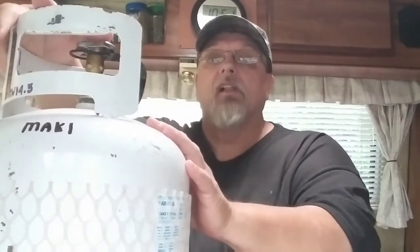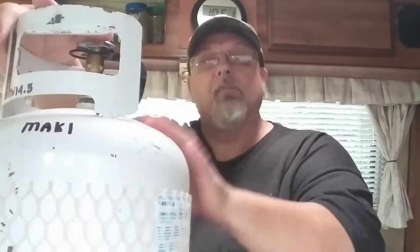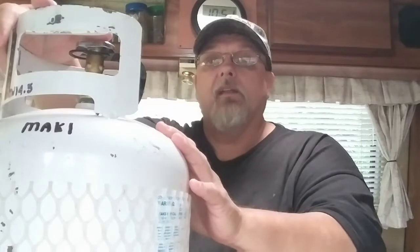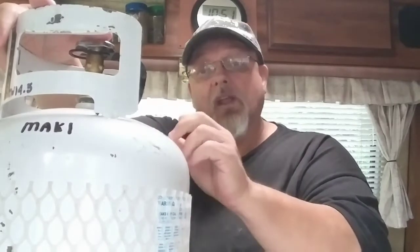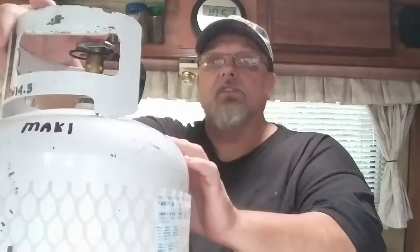So it's really confusing, but just remember this. Let's say you're using your barbecue. Make sure your barbecue's off, make sure your tank's off, and then turn your tank on very slowly so it doesn't ram that slam valve, and then you should be okay.